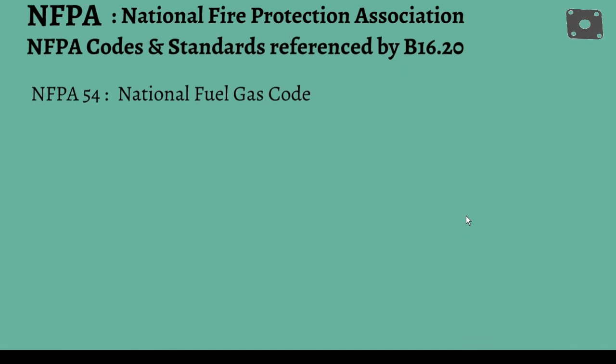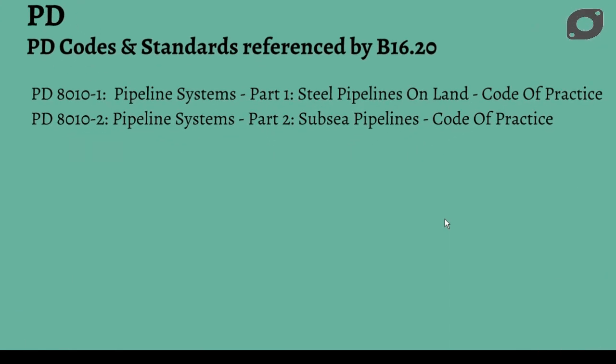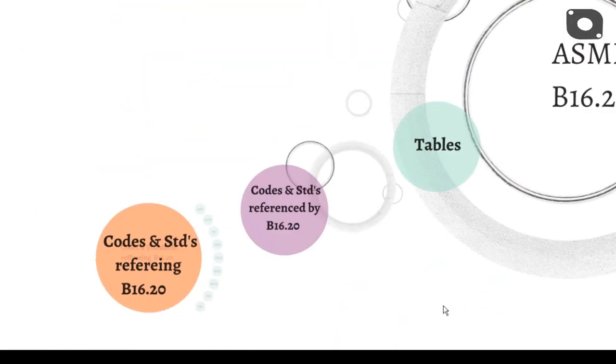The windings of the gasket can become unwound when the gasket intrudes into the flange bore. Possible severe damage to components and equipment can occur when the system is pressurized. The gasket will grow radially during the compression phase, and it is essential that proper clearances are used for grooves and recesses to compensate for this.